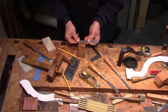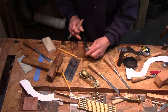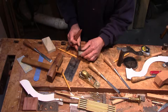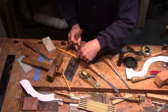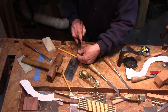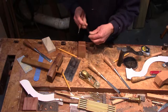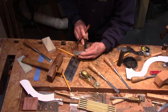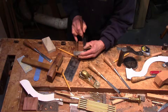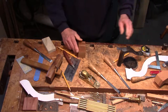It is. That's good. So what I will do is replace those pencil lines. I'll use a knife to cut down it so that I've got a groove, a knife cut to use with the saw. There's that one. That looks good. Okay, so the dovetail is marked out,